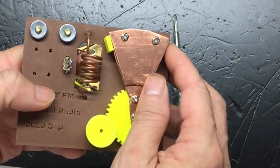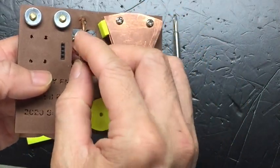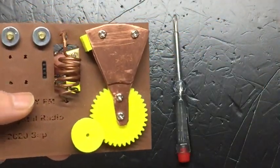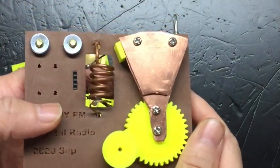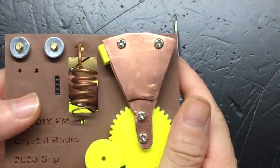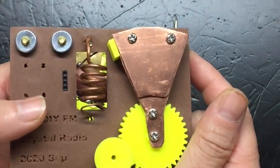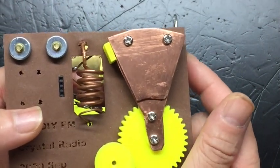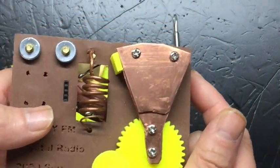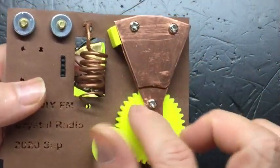You can reference the circuit diagram. I have a symbolic version of this MOSFET that can help you find which leg is which. The MOSFET will give you the best reception result in FM radio, in terms of selectivity, sensitivity, and clearness, the sharpness of the voice detected through slope detection. Slope detection is an indirect detection that turns the frequency-varied FM signal into AM first, and then detects it using the high Q coil and the high Q variable capacitor.